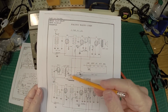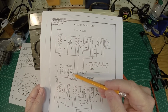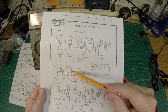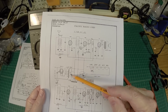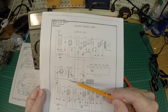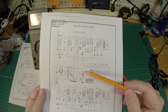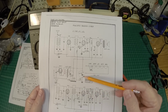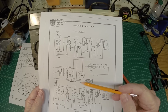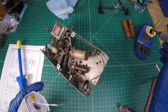So we'll follow that out in the schematic in just a minute just to make sure that this schematic I'm referencing is accurate. But I think I have the polarity here drawn correctly. The negative side should go back in and tie into that choke. So we'll confirm that in just a minute and make certain. But I think this one's ID'd correctly. Again, we'll have the negative side go to the chassis ground, then I'll see if this resistor is actually in this circuit as well.